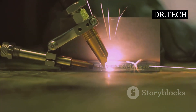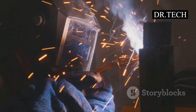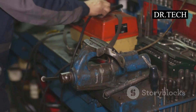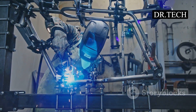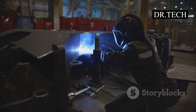The electrodes — those copper tips — do the real work. They press the metal sheets together, then electricity flows through them and into the metal. Because they are copper, they don't melt easily, but they do wear down over time, so they need to be cleaned or replaced regularly. Keeping these tips in good shape is key to getting good welds. A good spot welder machine, whether big or small, is a powerful tool designed for one purpose: to make strong, reliable spot welds again and again.